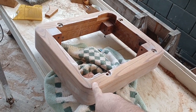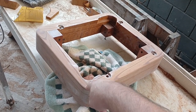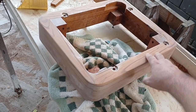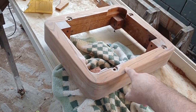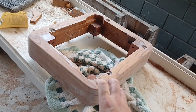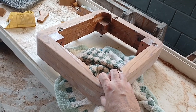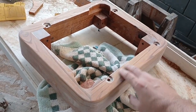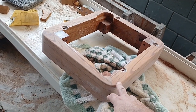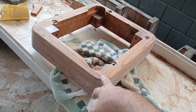If this does turn out to produce a good gloss finish, it's going to make a very nice guitar finish, this water-based polyurethane, because I'm shocked at how much level built up just from one day, two spray sessions, right? Normally with nitro, it's so thin, it soaks into the wood when you first spray it, and then it continues to dry so thin that you can't really level sand until you've done maybe a half dozen spray sessions, right? This has done it in one morning, so very good so far.